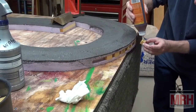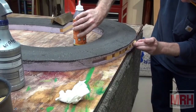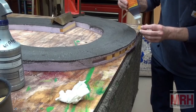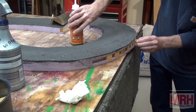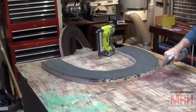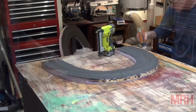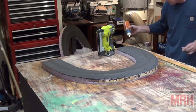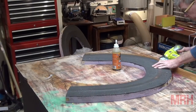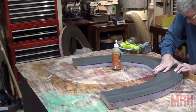Using the same process, I embedded small 3/4 inch blocks into the curved sides of the layout to which we will attach the oak plywood sides. I soaked a 2-inch strip of oak 1/4 inch plywood in water. I sprayed water onto the curved foam surface and applied a few lines of Gorilla Glue, then proceeded to wrap and staple the plywood into place all the way around the outsides of each layout section.